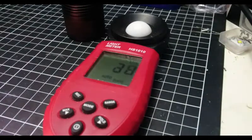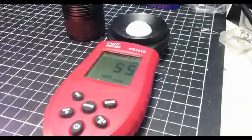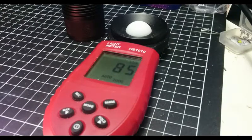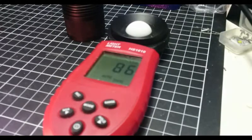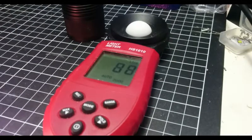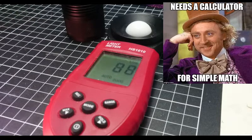First up is the XM-L2 — U2 bin. That's direct drive now. So about 87, 88 lux — pretty good effort. When I do my actual ceiling bounce test I usually equate 16.6 lumens per lux. It's going up now — 89. This would equate to quite a few lumens but I'll have to use a calculator. Usually my ceiling bounce test is done on the other desk and it's a bit more calibrated — this one isn't.